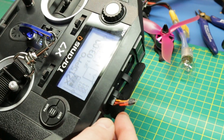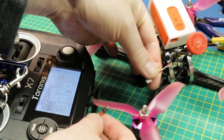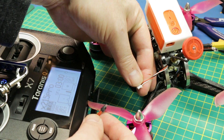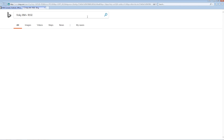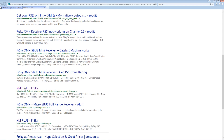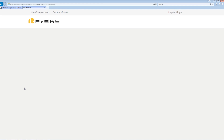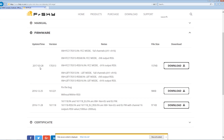We'll take it and plug our pigtail in and then bring this up to it and hopefully we can get it to flash. To download the firmware I just did a simple Google search for the FRSky XM Plus and RSSI. From there, just click the link to the FRSky website and you'll be able to download the firmware. It'll come down as a package with all of the versions you could need.